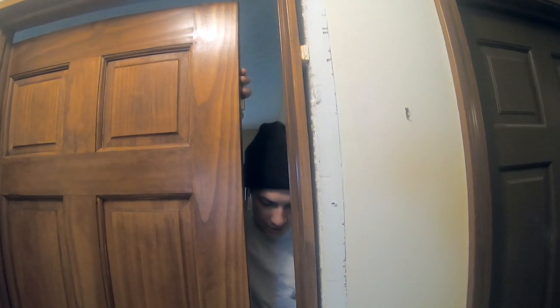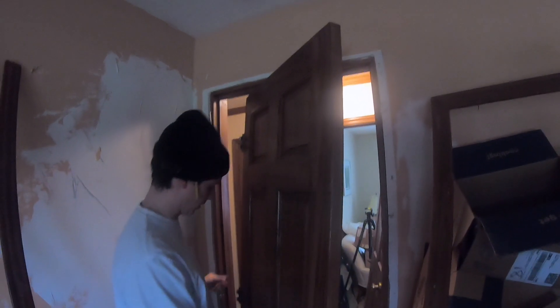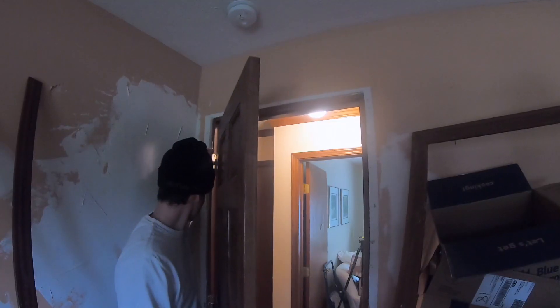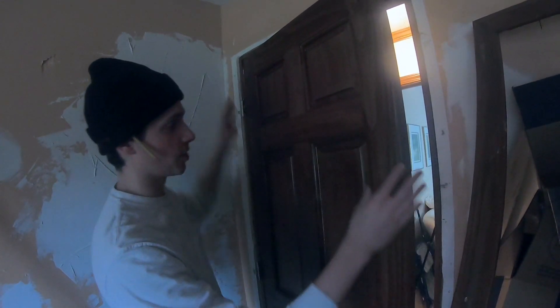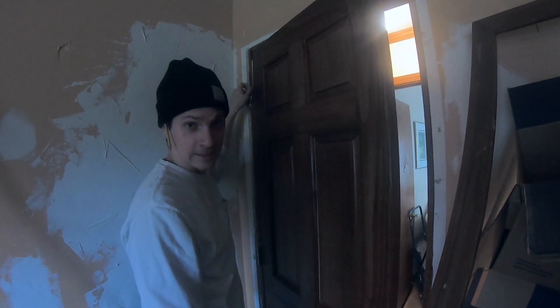Now you can see we've got these hinges — they should all be lined up because this is a pre-hung door. You have these hinge pins or little bolts that you're just going to slide through right here and that will keep the hinges in place. Now comes the tricky part where you've got to try and lift this door up and slide these hinge pins through. I like to try and rest the bottom hinge in place, then line up the top hinge and slide the bolt down. The hard thing about these doors is once you get them off the hinges they're machined to essentially almost no clearance, so the door has got to go onto the hinges perfectly level and you can really only put one bolt in at a time. You just have to play with it until you get a couple in and then you can usually muscle the last hinge on.